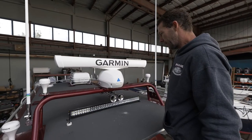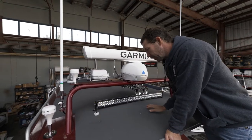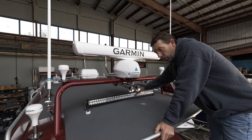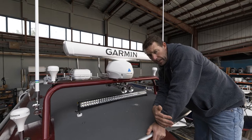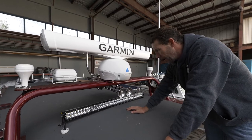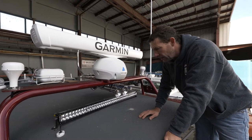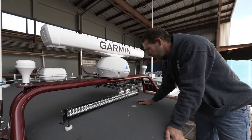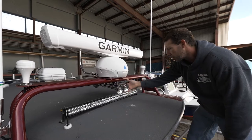Up here on top we've got all kinds of stuff happening. We originally had the horn mounted here, which was good, but our big light bar needed some space. We've done it in the past where we hang the light bar off the bottom, but the intensely bright light lights up the railing and pretty much blinds you. So we did some nighttime testing and found that if we put it here, we still get excellent light out front but don't light up the railing. We used the old seal for the horn — it's not perfect, but it's not making more holes in the boat. And the horn looks pretty cool hanging up under here.